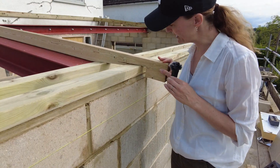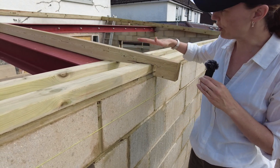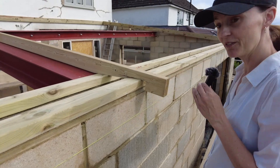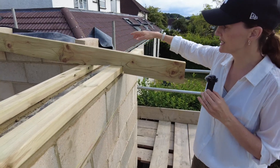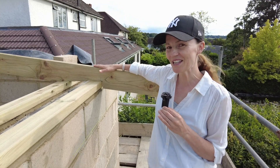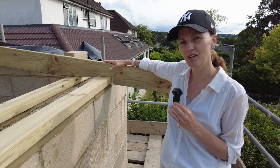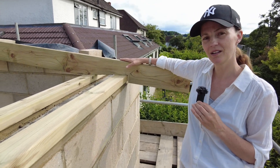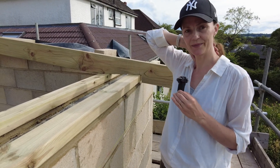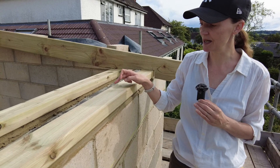They create a template to make sure they've got the right angle on the cut of the joist. This is the very first one that's been laid down — a six-point-seven-metre-long piece of timber. Why didn't we go for two pieces? Because if we went for two we would have an unsightly overlap in the middle if we wanted them exposed. We changed our mind — quite a bit of wasted wood because you have to overlap by a metre.